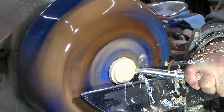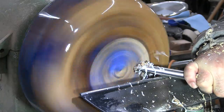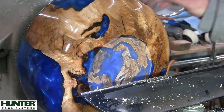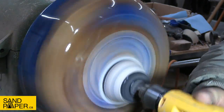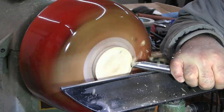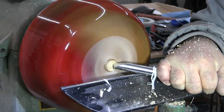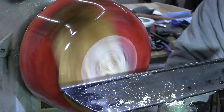So of course, the bigger the chuck, the more vacuum you're able to pull. If you had the 12-inch one, holy, you've got to be really careful, because if the bottom of your bowls are on the thinner side, you may possibly end up ruining them, either by pulling completely through it or collapsing the bottom of the bowl. So if you do get one of these big chucks, sometimes you may have to regulate how much vacuum you're actually pulling on the piece, or you possibly could destroy it.